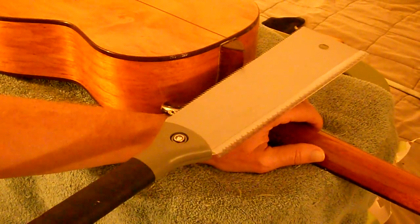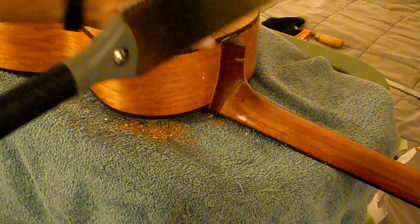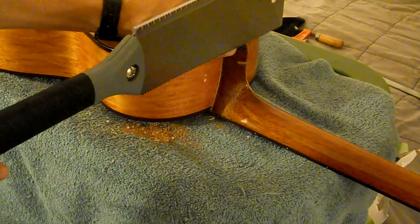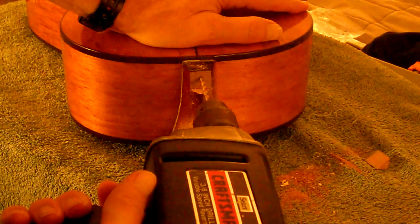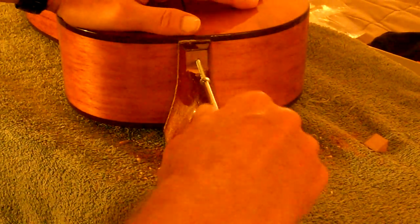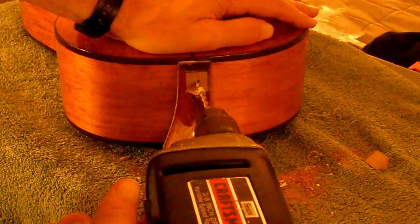I need to put an adjustment bolt right there on the knife edge of that wood — that's not a great place to drill. So I'm going to cut out a little platform. I cut in about a quarter to a half inch — actually a little too much; one eighth would have been fine. There's my little section and I'm going to drill a couple of holes. One hole is for the wood on the inside — you want it nice and snug — and I'm also drilling a wider hole just for the neck part, because I don't want the screw to grab onto that wood, only the inside wood.